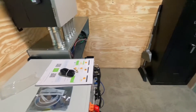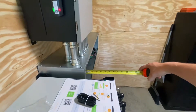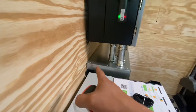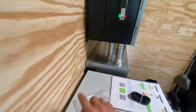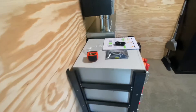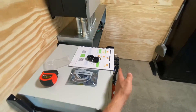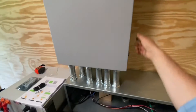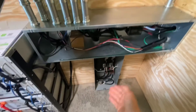You're not supposed to stick out six inches further, and that would have been seven, so it wouldn't have been able to work. If you shimmed out your inverter or built some kind of shelf so the battery sits back a bit — technically from a code standpoint, they don't want you leaning over this stuff to work on it, since this is considered switchgear, and that down there is switchgear too.